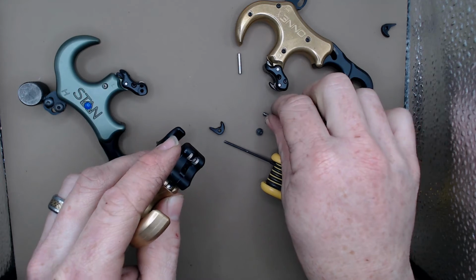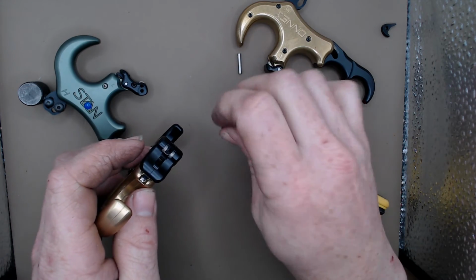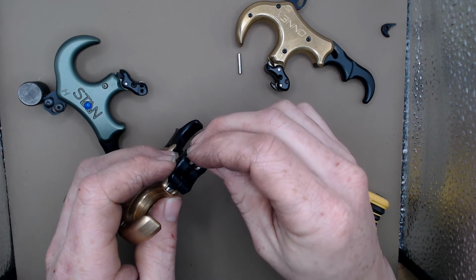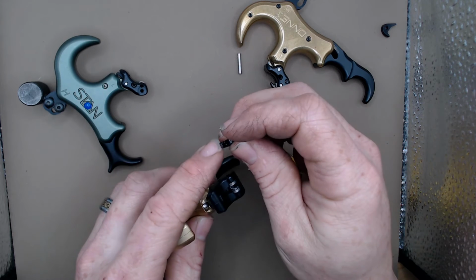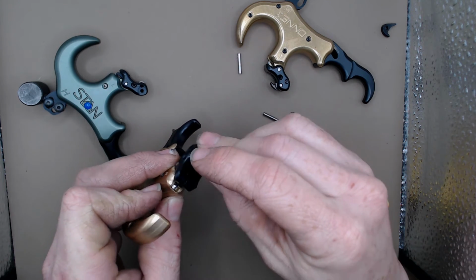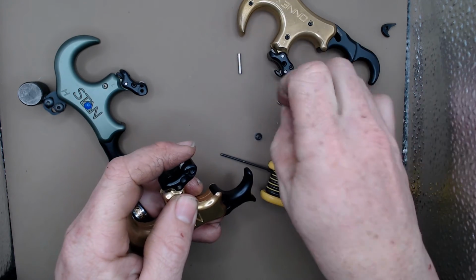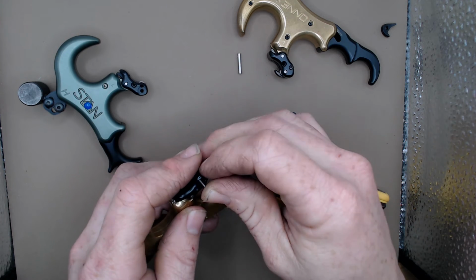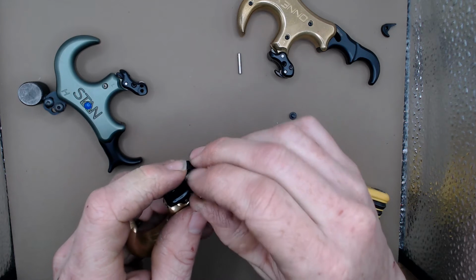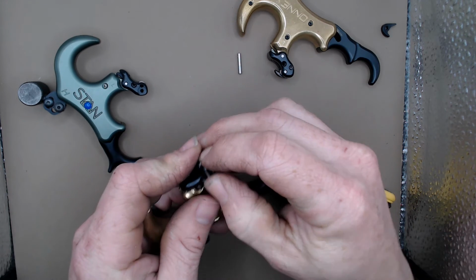So that one pops out on its own for some reason, so that can stay over there for now. That's a smooth hook. I'm never going to use it. So I'm going to put the click hook back in. You need to get this part of the hook underneath the leg of the spring that connects the 2 sides together. You're going to need to push down a little bit to line up the holes to push this pin back in, which is never easy when done on camera.